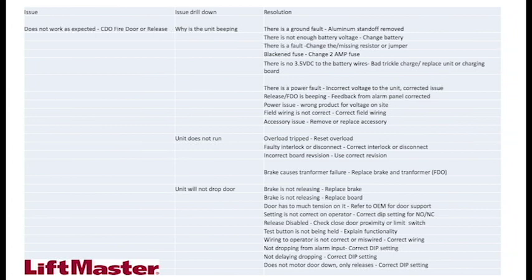And then I also have the scenario of why is it not operating, no LEDs lit. That goes from there being no incoming power to the unit, the breaker popped, turn it back on, see what you got. Secondary power: if you don't have 24 volts coming out of the transformer, but you've got 120 coming in, we've got a bad transformer. No need to go any further. If I have what goes in, something has to come out. It doesn't have to be the same voltage, but it better be something.